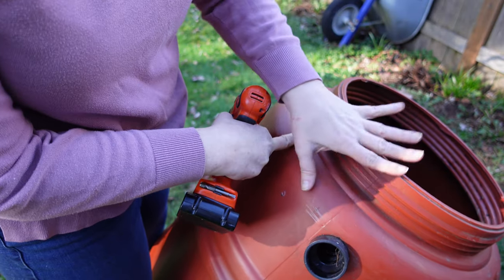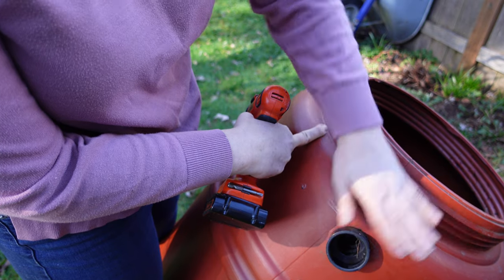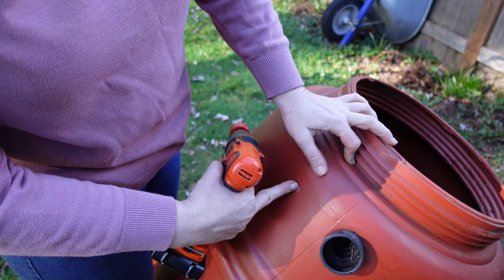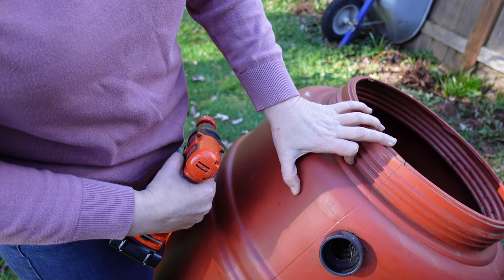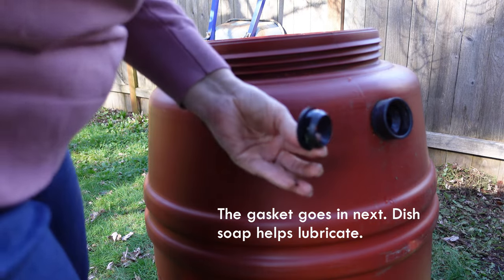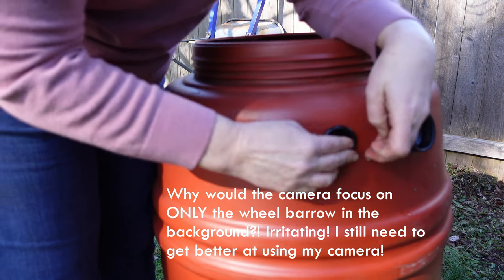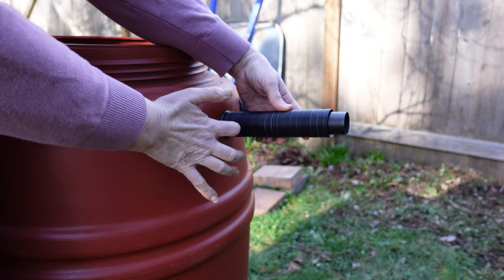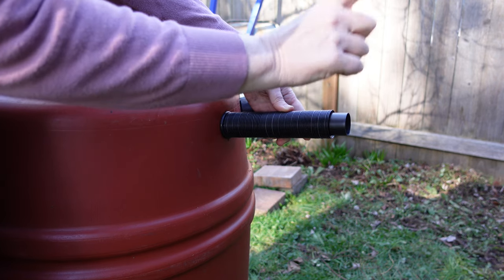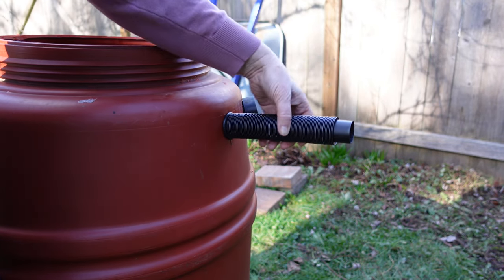This is a used barrel so it already has a hole in the side, but it's the wrong size for the kit I have, so I'm just going to block it off and drill another hole. Go three inches down from the top, and you don't want the hole to be on the curve — you want to hit the first flat spot with no ridges. I made my mark, lubricated the bit a little, put it in, let it expand, and it cinches right in there. Now that the hole is in the side, this is the diverter hose — this end is going to go into the downspout. Now I'm going to put it up on the blocks and mark where I cut my hole into the gutter.